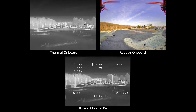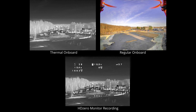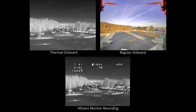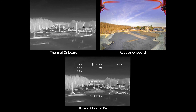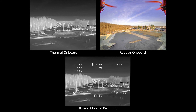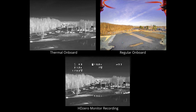For this first flight I'm flying during the day just so I can see the drone more easily. The thermal camera works just fine in daylight — the sensor is only sensitive to thermal radiation, so sunlight doesn't affect it. And even though this is the lowest-resolution thermal camera, I think it's not too bad. It's definitely usable and I can easily pick out people and cars far out in the distance. 256 pixels doesn't sound like a lot, but for identifying objects it does the job.